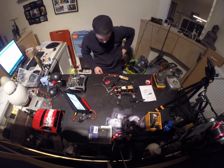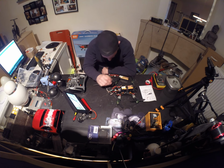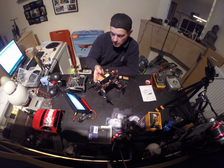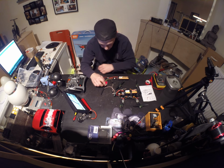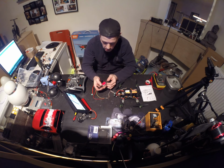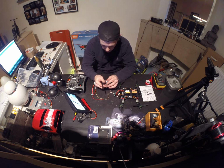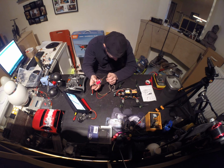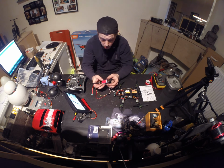So what I'm going to do now is take the power from the 12 volt pack that's installed in here. That was the whole thing. See, it's a perfect image now. I'm gonna take that power up there and power the camera and the transmitter separately from that pack, so I get a clean signal from the pack at 12 volts. I think that's the only reason why I don't get a nice signal. Because there's so much interruption on the battery, I think. There's so much noise, probably, I don't know.